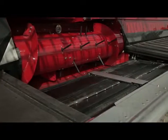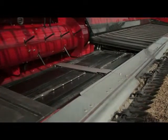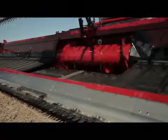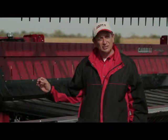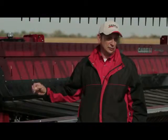You'll also notice it has a wider infeed system with two infeed belts — 10 inches wider than a 2162 — designed to maximize the throughput and capacity of an axial flow combine. This knife drive runs at 1,260 strokes per minute, the same speed as a 2162. It requires no mechanical adapter because it's designed specifically to take advantage of the Case IH axial flow combine.